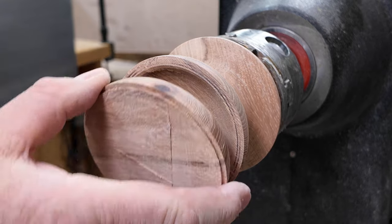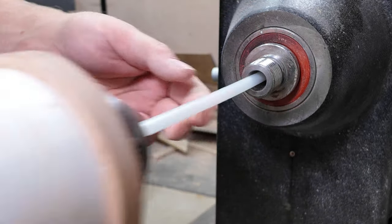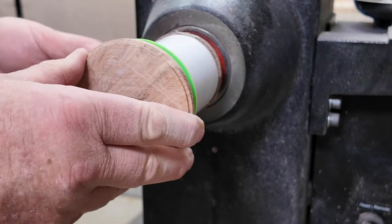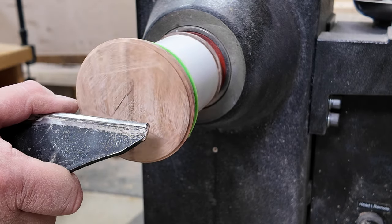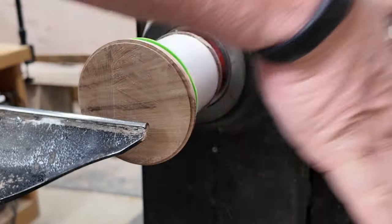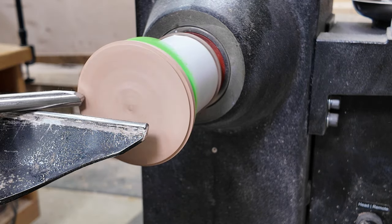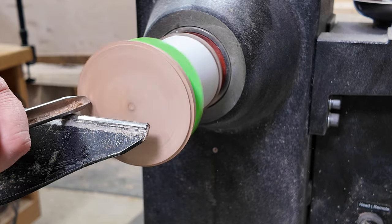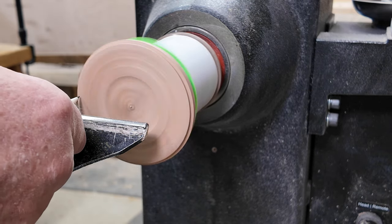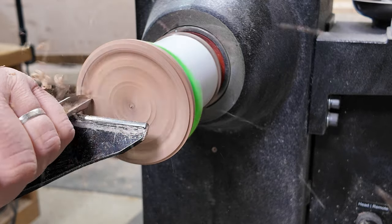Now that side is pretty well hollowed out and I'm using the lid to get that hollowed out too. I've opted to use the vacuum chuck — this particular chuck head just sucks the piece straight in. I needed a smaller one so I changed over to the green one, about a 2-inch diameter. Making sure the piece is held straight into the vacuum chuck so it doesn't wobble — just hold your thumb against the rim and give it a tap left and right while it's spinning. I did some research before I settled on the Frugal vacuum chuck. It's an extremely handy tool, well worth the money — I think I paid something like $250-$300 for the whole kit including the vacuum pump itself.